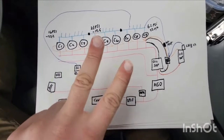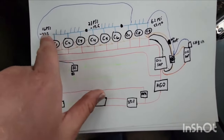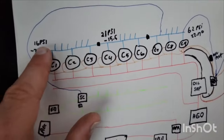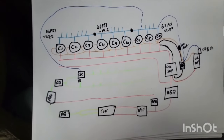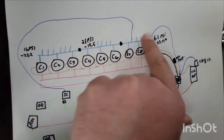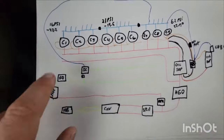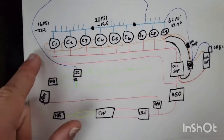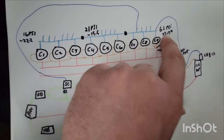Next up is touching the rack. As I showed you in the video, you touch every single suction line. If you have a rack like this that has all the lines coming out from the floor, you touch every single one of those, then every suction end bell, every discharge, every oil line, and you check: is everything blue?